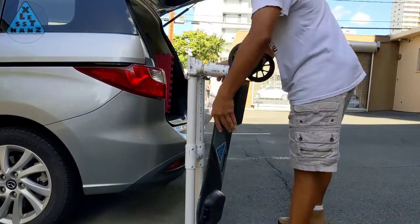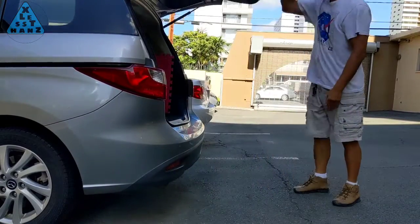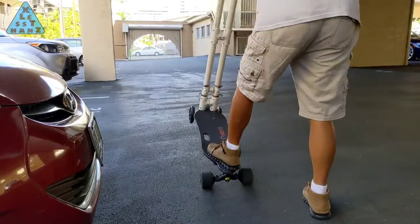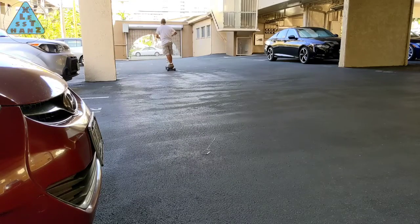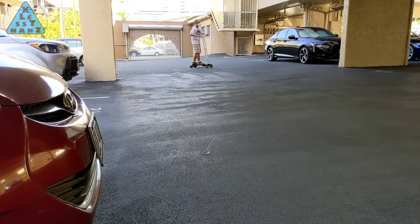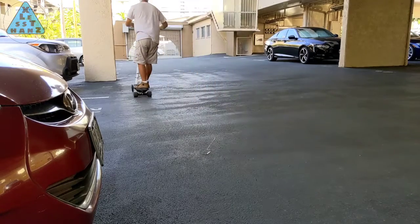Transporting my Meepo scooter without having to dismantle the handlebar to fit the scooter in my van is so much easier now. Handling and riding feels the same. One thing I have to admit though — I did get tired of using the quarter as a tool to loosen the hose clamp, so I started using a small socket extension with an 8mm socket that fits the hose clamp hex head, which felt a lot less painful on my fingers. This is the last of my 3-video series on turning your electric skateboard into a convertible electric scooter slash skateboard. Leave your questions and comments in the comment section below — that's all I have for now and I'll catch you in the next video.